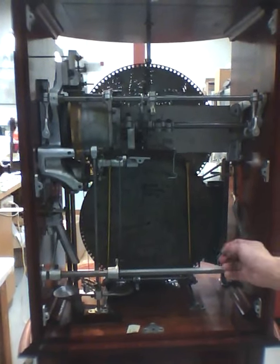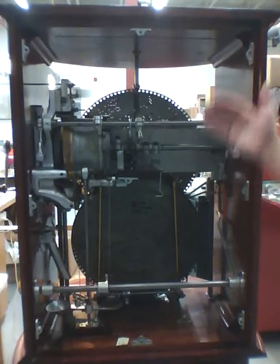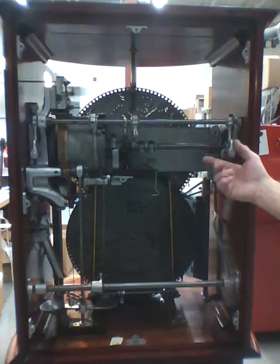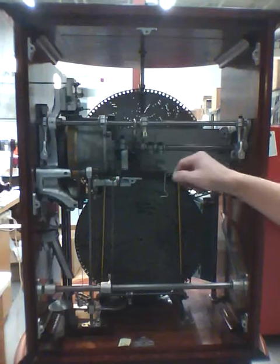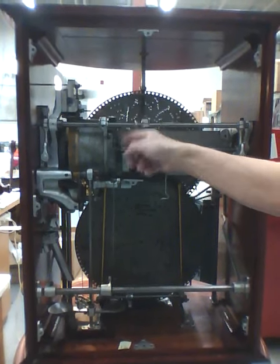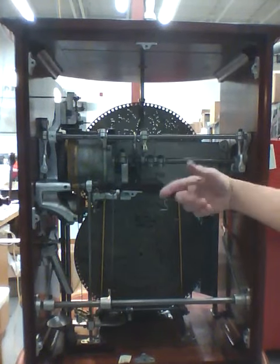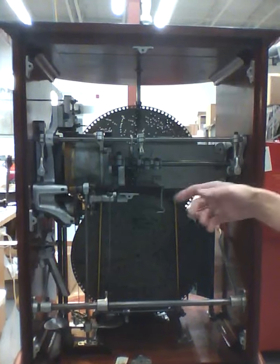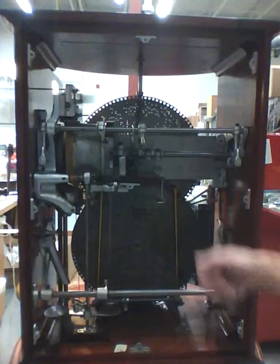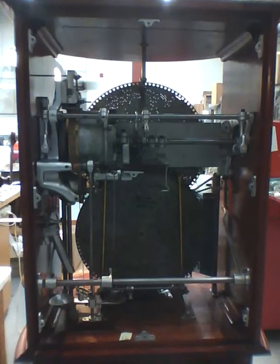It's a carriage with 12 discs, and every time it completes playing one disc, it puts it back down, picks up another one, and plays the next one. There's a mechanism operated by a series of cams that run on this cam wheel here. At a certain point in the revolution, the pressure bar will open up and another cam will lift the disc out, another cam will push the next disc into place, and like that. So it's all mechanical, clockwork motor driven.